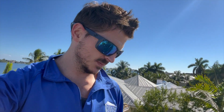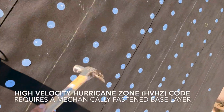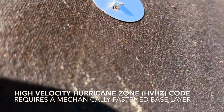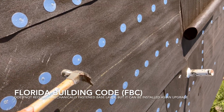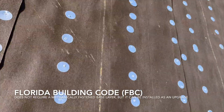It's day 2 of the project now. What I'm doing is going around with the trusty old hammer and re-nailing some of these nails because sometimes the nail gun shoots these nails out crooked. So you have to go back with the hammer and re-nail the nails. This is the tin cap nailing on the roof. You see that nail? Gotta bash it down straight.